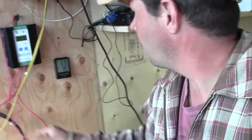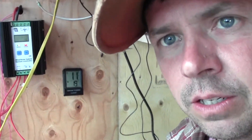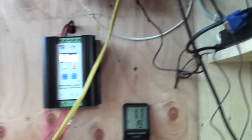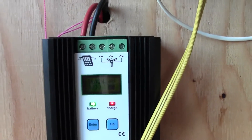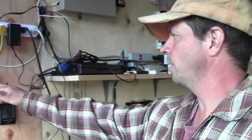It runs pretty well. Right now the power is at 24 volts — 24.7 — and it's still inputting. This is kind of one of those things: it's at 24 volts, but today was a beautiful sunshine day. Those batteries should be completely topped up and at float, but for some reason they're not. I'm going to wait to get the wind hooked up and see if that does anything different, but basically I'm not very impressed with the Eco-Worthy system.